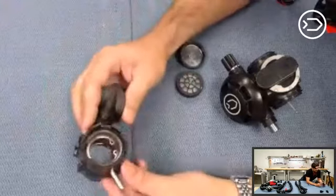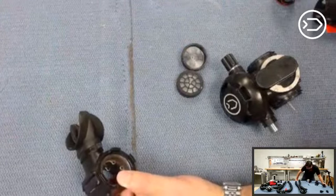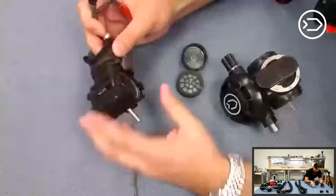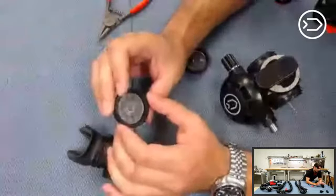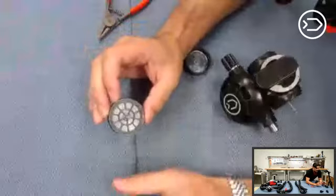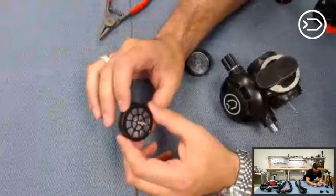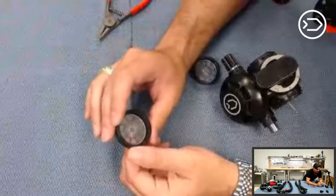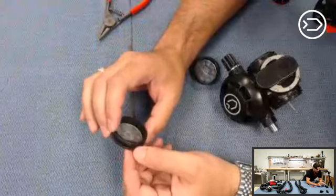All right, yes. So I definitely want to take apart some of the gear so you guys can see what makes it work, right? We have our baskets. These are our mushroom valves, or some folks call them the flapper valves. These are the fundamental components of the dive surface valve or of the rebreather mouthpiece, as they control the directional flow of the gas. We always want to check and make sure that they're in good shape, that they're not changing colors on us. That's part of our one-way flow check. We want to make sure that they're properly functioning.